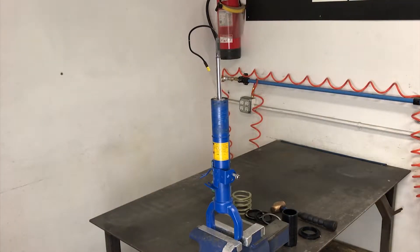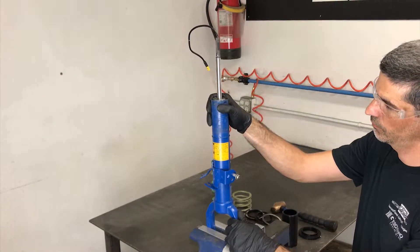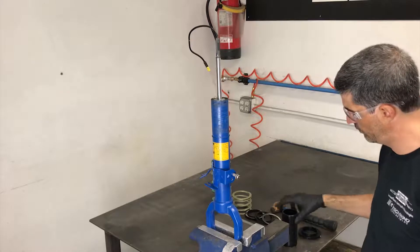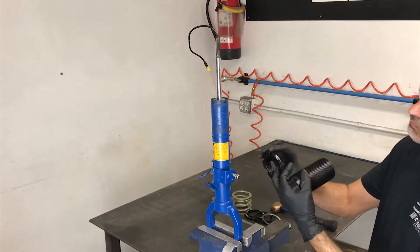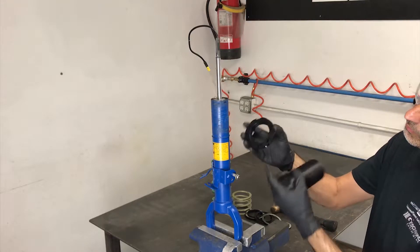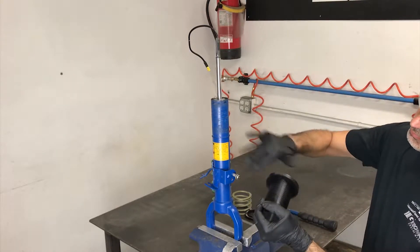To assemble, the shock absorber has been placed in a vise with soft jaws. Make sure not to clamp down on the shock body to prevent damage. First, loosely install the set screws into the spring perch. Screw the spring perch all the way down onto the threaded sleeve.